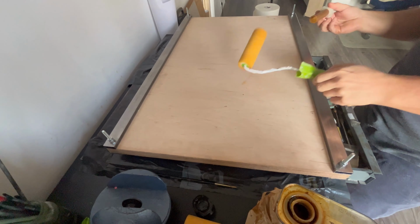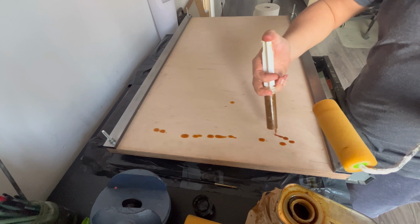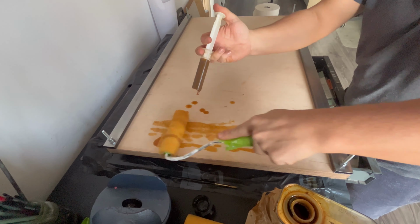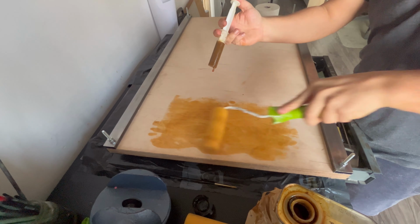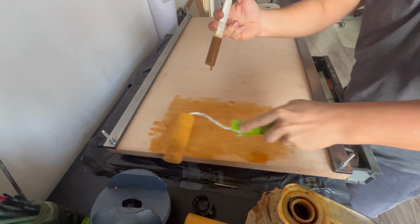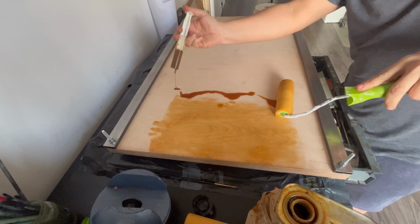The table is impregnated with wood oil. I used tung oil as it was the type I had. It was recommended to me when I was creating a kitchen knife, to be used for the knife handle. This oil is extracted from Chinese tung tree seeds. It penetrates well, has a clear coating and hardens in contact with air. It is widely available, but you can use something else if you want to.